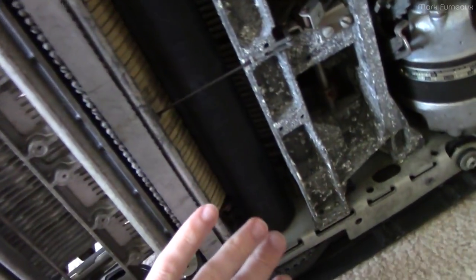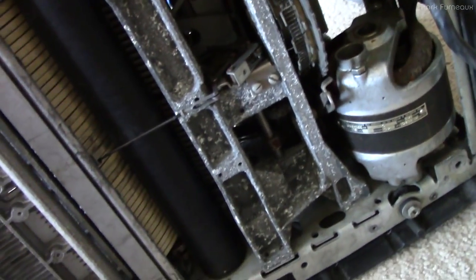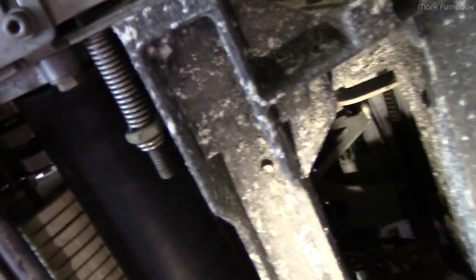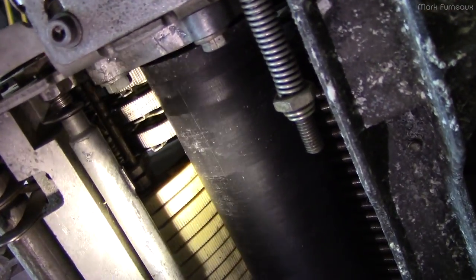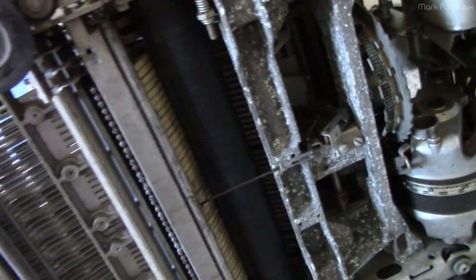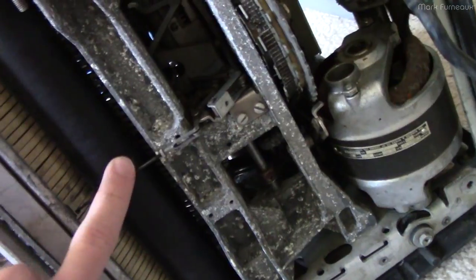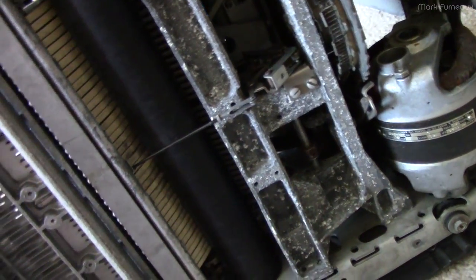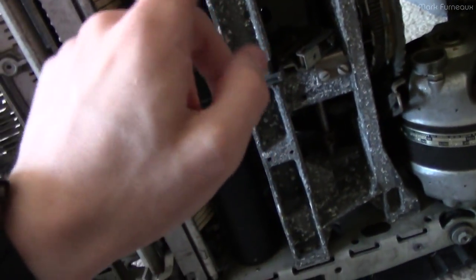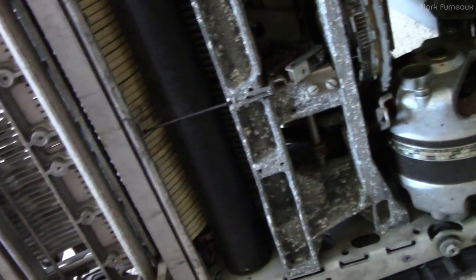As soon as you press this wedge against the rubber roller - because it's rubber and the paddle is toothed and grippy - you don't have to exert any more energy. The motor imparts the energy through the roller, pulling the paddle up, and that transfers the energy from the motor into the hammer. Everything - backspace, space, ribbon advancement - is performed this way. There are three metal dogs on one side and two on the other. Really all of the energy gets transferred through this roller at some point.